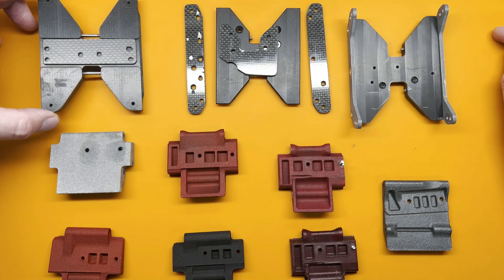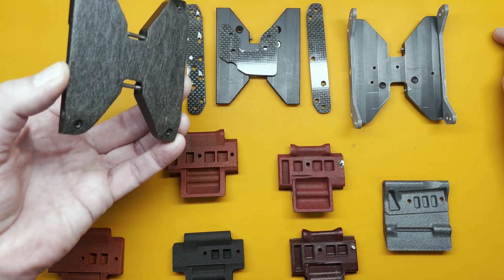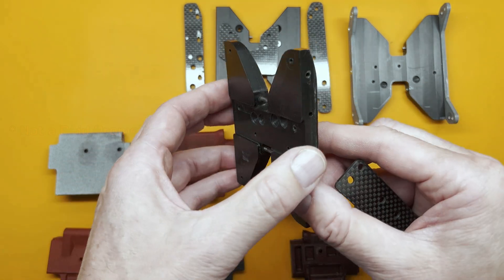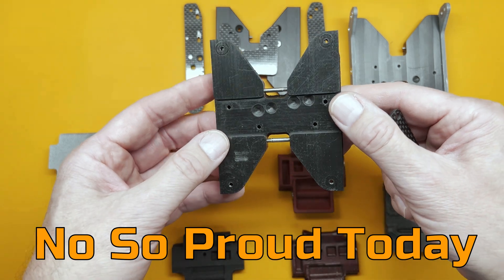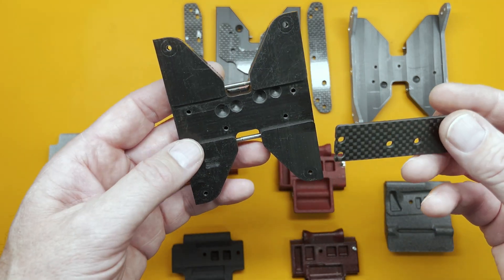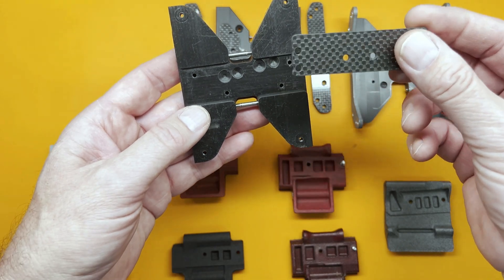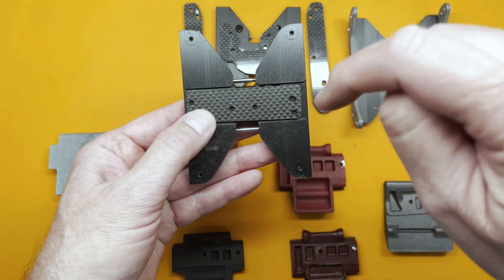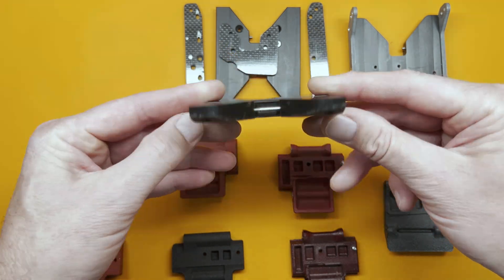The very first platform I had was a Capra, like many of us, and this was a custom skid that I made. It was completely CNC'd out of Delrin, and it was about 250 bucks from Proto Labs. I was really proud of it, but ultimately it's just a Capra — it has a lot of weight and isn't really conducive to rail designs and a lot of modern designs, so I didn't keep this for very long. I did have a carbon plate that I bolted first to the transmission and then bolted to the skid from the top, so there were no bolt holes in the middle to get hung up on things. I thought that was pretty clever.